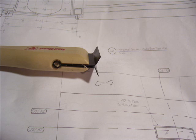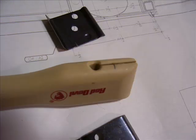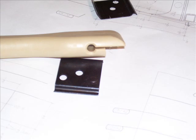I'm going to show you how we modify it, because we can't really use it the way it comes in the package. You can see here it has two blades — it comes standard. One of the blades, if you're scraping inside of a cabinet and scraping the glue out, it'll gouge into the sides. So the first thing we do is take out the blades and use one of them as a guide. You can see here where we've marked one side with a pencil, past the big hole in the middle of the scraper blade. You can use a hand saw or a band saw to cut off one side of the plastic or polycarbonate, whatever they make it out of.